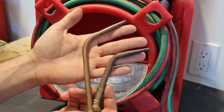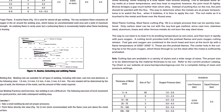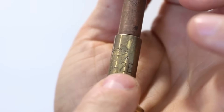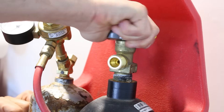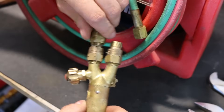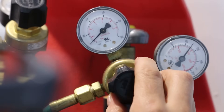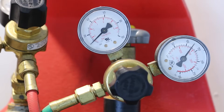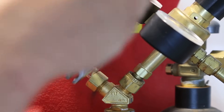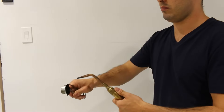Now is a good time to choose the torch tip for your application. Each manufacturer provides a chart specifying which tip to use for the material thickness you're working with. For this demonstration, I'll be using a number 2 tip from Harris. Once both tanks are filled, give them a quick purge to ensure no contaminants enter the torch assembly. Install both regulators, connect both hoses, then the torch. Open both tanks and adjust both regulators to around 5 psi. Once full pressure is reached on the oxygen side you can fully open the valve, but on the acetylene side open it only a quarter turn after the gauge reaches full pressure — this allows easy closure if an accident occurs.